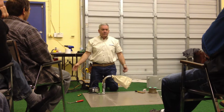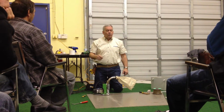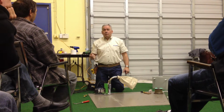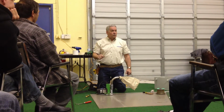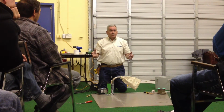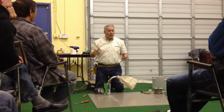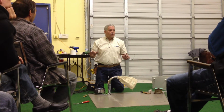Okay, well, that's fine, but heat welding is all about the flow and the go. In other words, if you turn that sucker up, you got to move. If you turn it down to 3.5, you're going to go slower. But even on our heterogeneous materials, depending on the color of it, it's going to show scorching more. So I always set my heat first on a piece of scrap.